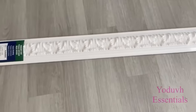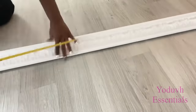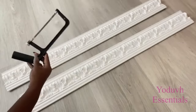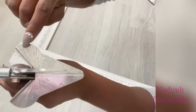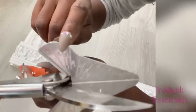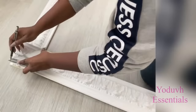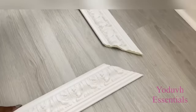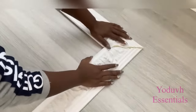I'm going to measure and cut down the crown molding to size. When I was done, I cut it down to size. This cutting tool would have been used for the project because it's used for cutting trims at different angles. I will leave a link for this down in the description box below. It is perfect for smaller trims. What I have is something much wider, so I couldn't use the cutting tool. But I'll be making 45 degree cuts at all the four corners with a regular saw.